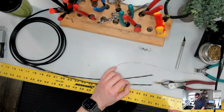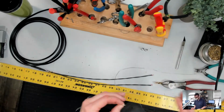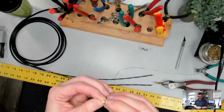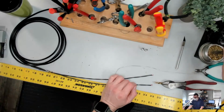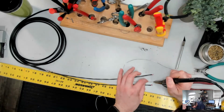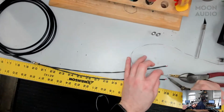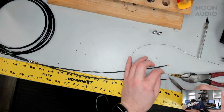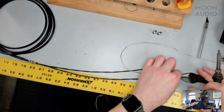So using those pliers is kind of something to hold that in place while you solder. Nice. Yeah, so what's interesting is it's kind of perfect because this has a little notch there, which aligns with the notch in the clamp of the continuity testers. So now I'm just gonna tin this. Watch your head there, Daryl. You're good. Go for it. Tiny little plug. Very delicate.